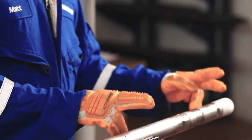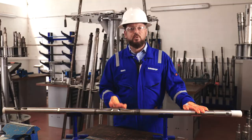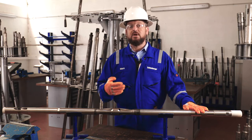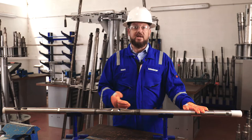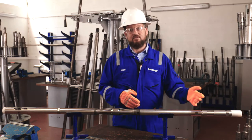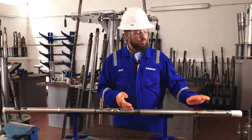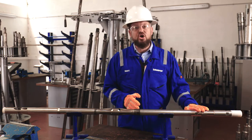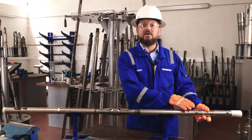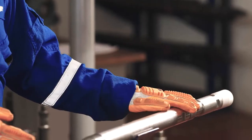The DCR, the digitally controlled release, eliminates the need to drop a drop cutter should we get into a situation where the tool string has become stuck in the well and we can't jar away. This is particularly important for activity on lightweight intervention vessels where with a subsea lubricator one could not drop a drop cutter if stuck — likely we'd have to cut the wire and move away for a further job, maybe with a rig. With this tool we can release on command, disconnect, and leave both an internal and external fishing profile so we can go in with a more heavy-duty fishing string if required.